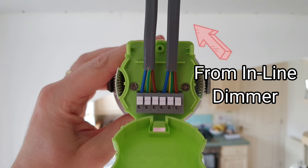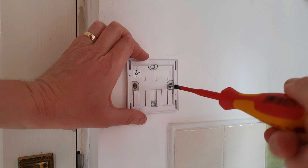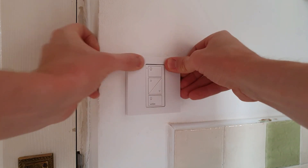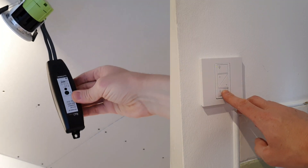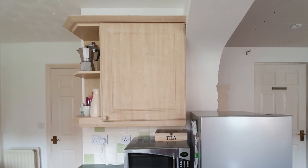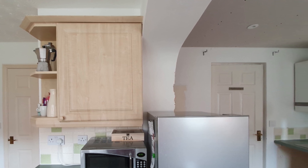Then it's just a matter of connecting up the other fittings. I can install the new switch position using the Pico remote — and you're going to see the versatility of this control as the video unfolds. Here we can see it can be easily fixed to the wall. With the Picos mounted and the inline dimmer connected, we simply pair the Picos to the dimmer and it's good to go. The inline dimmer goes through the downlight hole comfortably. We've got the switching for this area sorted, and look at all the mess I haven't had to make — no chopping, no cables and boxes to fit, no flooring taken up, no struggling to route cables through tight spaces.